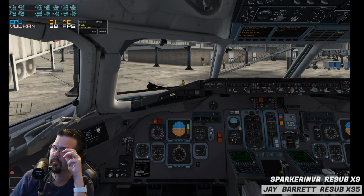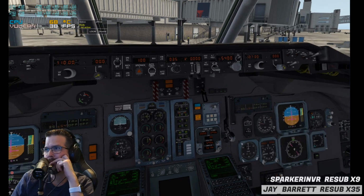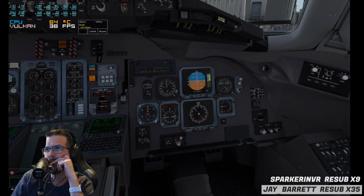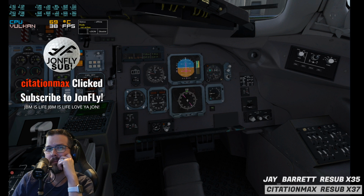This is per an American airline carrier's SOP. On the A and B engine pumps, we always leave them on because you don't want to deactivate the solenoid. The engine pumps aren't going to come on until the engine comes up to enough rotation to spin the pump in the accessory drive, so there's no harm in leaving it on. There is harm in turning it off because you're wearing out the solenoid. I'm thinking of the electric pumps. Electric pumps are different. You turn those on, and later on you shut them off when you get to the gate. You wear them out.